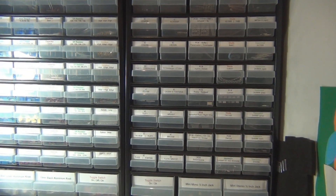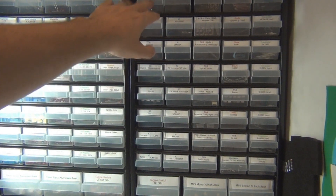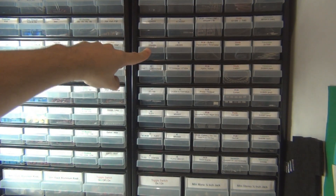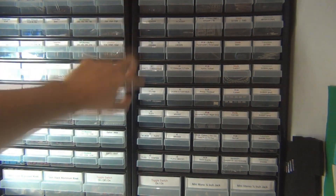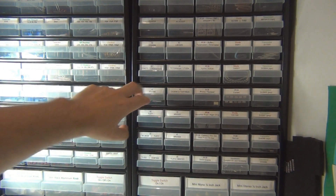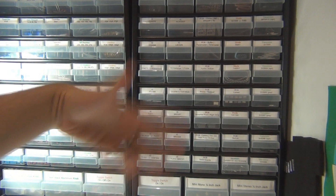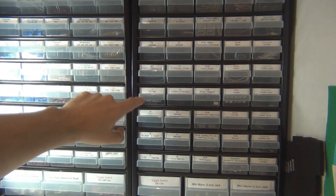Moving over to my parts box - this is where all the action happens. I'll go through these and tell you which ones I think you should stock up on. I wouldn't bother with any of the CD chips because you only need those when you need them. PT2399 - if you're into doing a delay you could definitely buy a few of those. You probably only need maybe three for your lifetime depending on how many you're building, but three on hand would be handy.